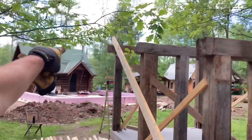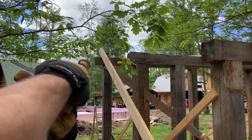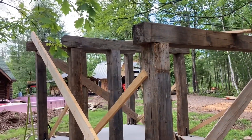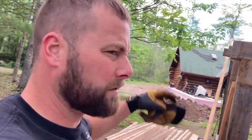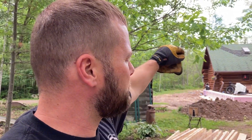I'm going to nail some 2x4s proud of the first wall and this back wall, then butt the rafter up to it and trace that line. I probably should do all three because otherwise it's going to sag and not give me a right measurement. I'm just going to bird mouth cut them. I'll cut one and then make a jig and cut them all the same.